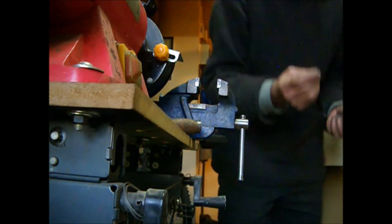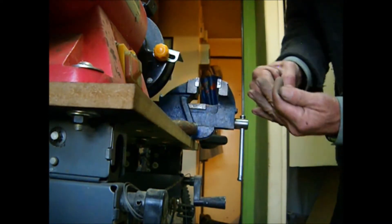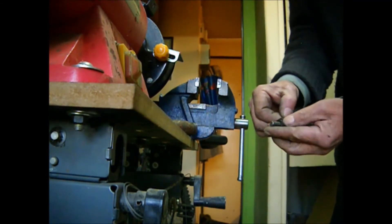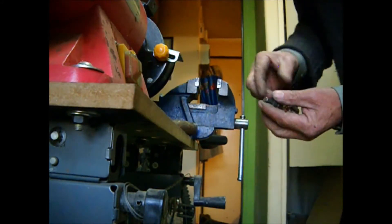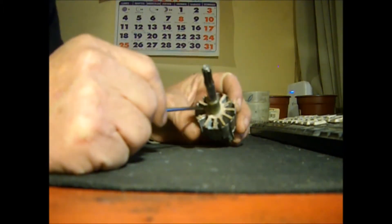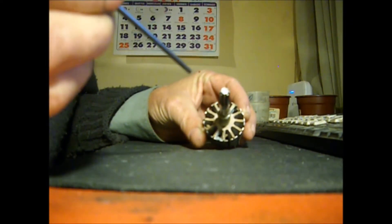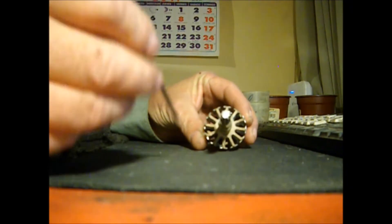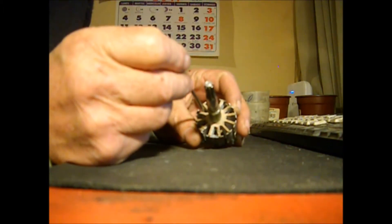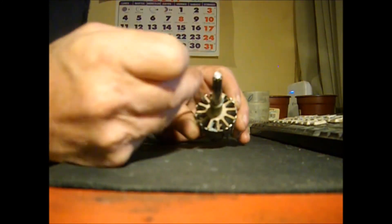Although in this case it broke into many pieces. After we have both copper blocks off the ends of the core, we have to remove the copper inside the core. This is the core where the inner windings of copper go. The tool I use to get the copper out is a steel bar of about 2 to 5 millimeters in diameter, depending on the size of the holes. Then I hit it with a hammer and push the inner block of copper down and out of the core.